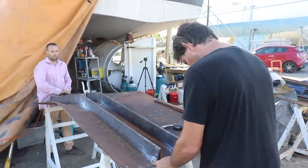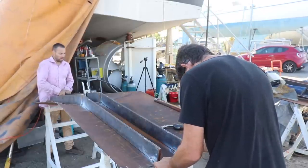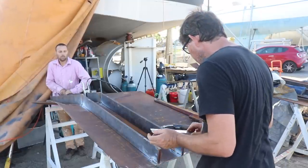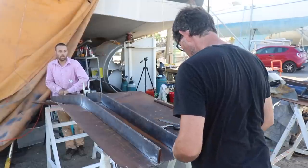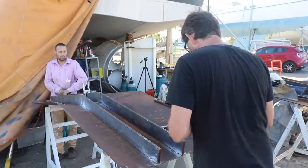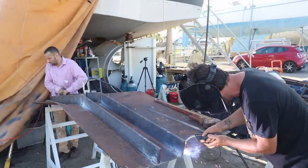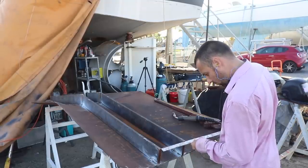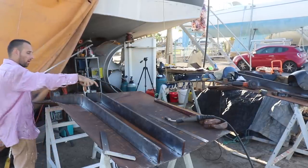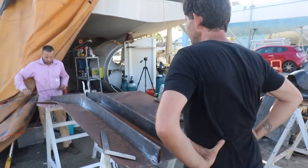At the moment, out to out is 197. For 198, and the top's 194. So it's got to get out that way, like that slightly. Yeah, that's closer to straight. Can you just give it a quick squirt? So 166, that's good. 164, we're 2 millimeters out over that leg. Probably acceptable. That looks quite close. 145, we're 20 mil.